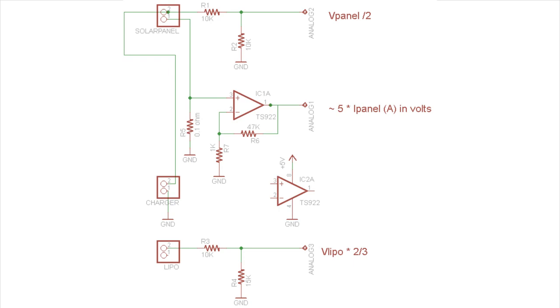Okay, well you can also do high side. Low side is kind of annoying because you have two grounds, you have the real ground and then the fake ground. So there's also high side sensing and it's kind of like this but the other way, the resistor is on the top of the power supply. But this also has some issues. One, the voltage that you're measuring on the power might be much higher than the voltage of your op amp or your circuit. Like you might be measuring a 12 volt battery or a solar panel, but your circuit is running at 3 or 5 volts. So you can get a custom chip, and some of these do the gain and they can have high voltages, and so you can do higher low side sensing.